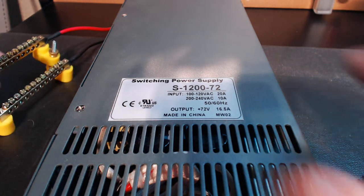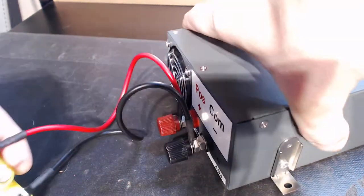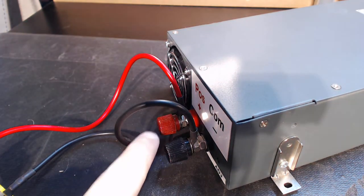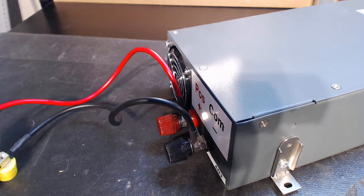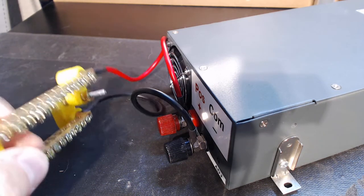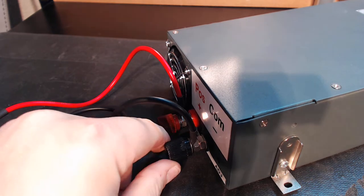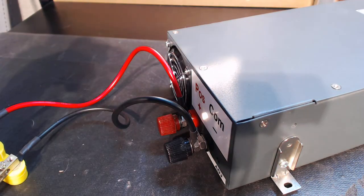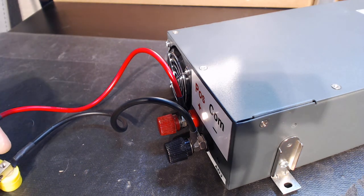The beauty of this, especially when you're dealing with a Pro-Grade system — let me just turn it around and show you — is the fact that you can remove one terminal. These just simply unscrew, and once they unscrew, you remove the single terminal and the entire terminal block gets dismounted. What that means basically is you never have to disturb any of the wiring in your entire enclosure. If all your drives are hooked up and you have to service the power supply, you simply unscrew the terminals, then unscrew the four screws that mount the unit to your base chassis, and you can either clean or replace the unit. That to me is amazing time savings.